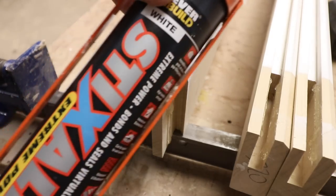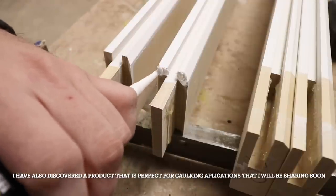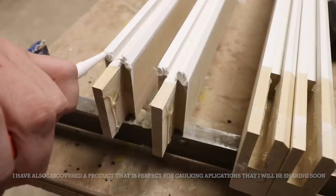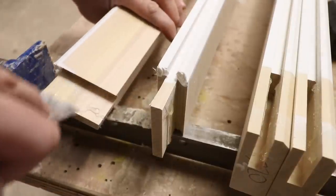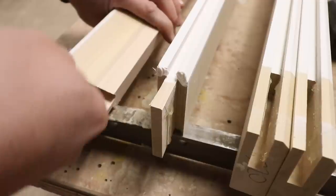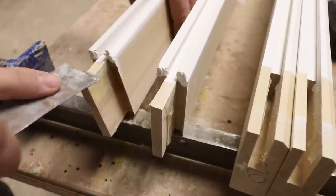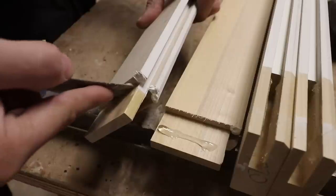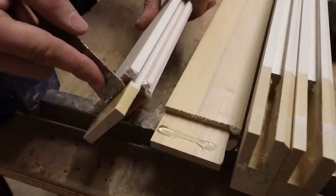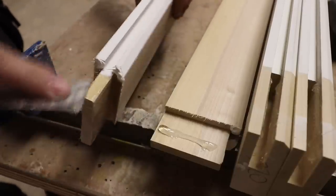I'm using this white Stixall, but it's actually an adhesive and sealant in itself, so I'll put just a blob of that on the inside edges of anywhere you don't want to get any glue squeeze. Because that's an adhesive in itself, it will actually help to bond that joint together, but what it does is stops the expansion of the PU glue spreading out the end of the joint where you've applied that sealant. Then I'll get a liberal coating on all the end grain — it does tend to suck up into the end grain a little bit, but that's where PU glue is an advantage to traditional runny glues.